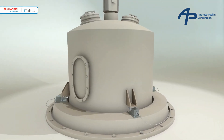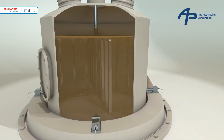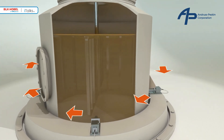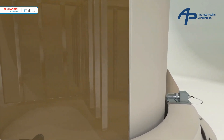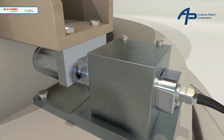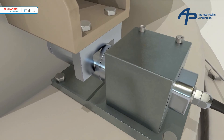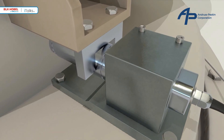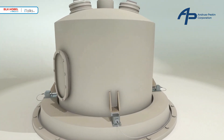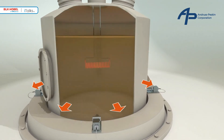Batching with heating or agitation are typical applications where the KISS load cell delivers. Agitation or movement from the use of mixers is a common problem. The KISS load cell withstands very high lateral forces and delivers accurate weighing even under these conditions. Heating of the medium in a vessel can cause thermal expansion, but the design of the KISS load cell allows for movement of the loading point. The load cell will deliver accurate weighing in accordance with the datasheet specifications even when heating from the process itself or a change in ambient temperature causes thermal expansion.